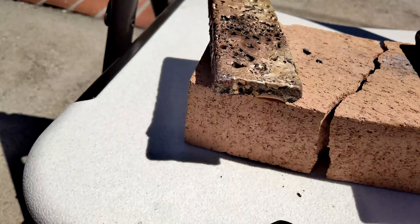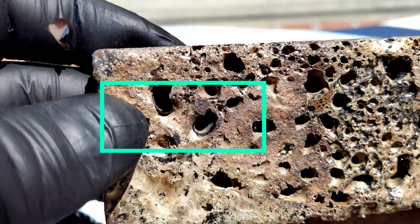It's having some difficulties — you can see there's an indent right here. I've got a protrusion in my mold that's actually sticking from the cast iron out into the ingot, so I'm going to need to get the Dremel and file that down. But yeah, there's a bunch of different holes.